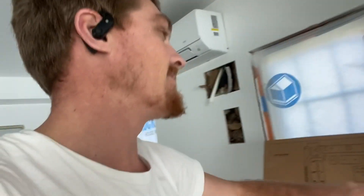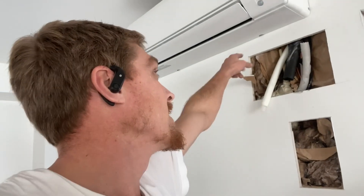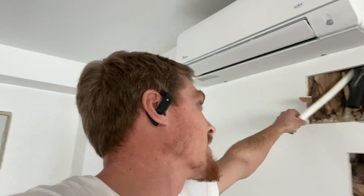I went around and made all my line sets come out to the right side of the bracket, and so that was a huge mistake on my part. The only thing we could do at that point was cut a hole in the drywall so that they could make the connections behind the wall. And even that isn't totally ideal because now if you ever need to get to those connections, we're going to have to cut the drywall out again.